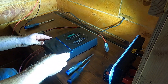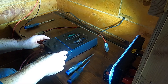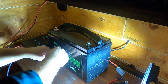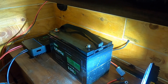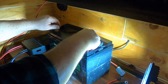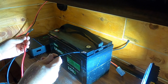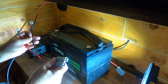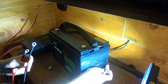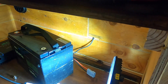That's all I need to connect up. So let me get this cover plate on. I've got my HQST battery here. What I need to do is get my charge controller connected up to my battery, and I also need to have my positive and negative cables going to my DC fuse box. I've got that connector right here — I just need to connect this to the battery and then I can connect that up.